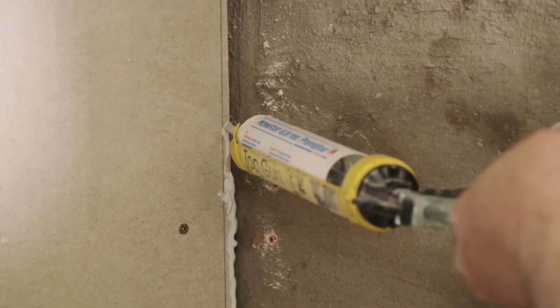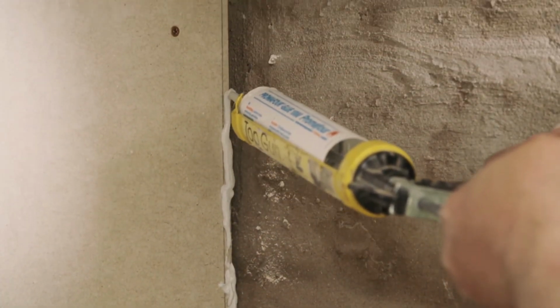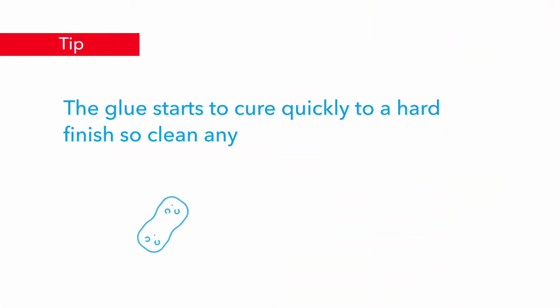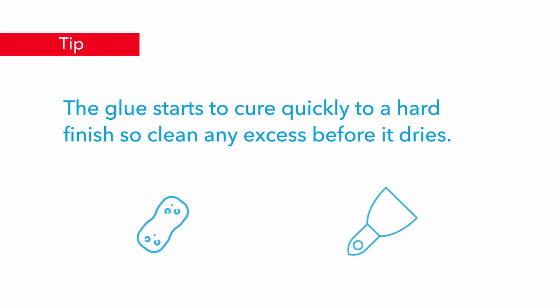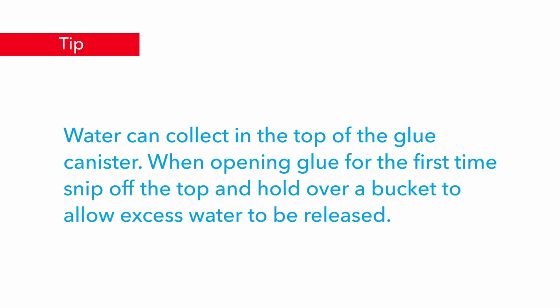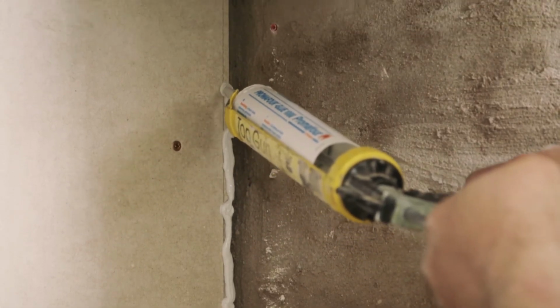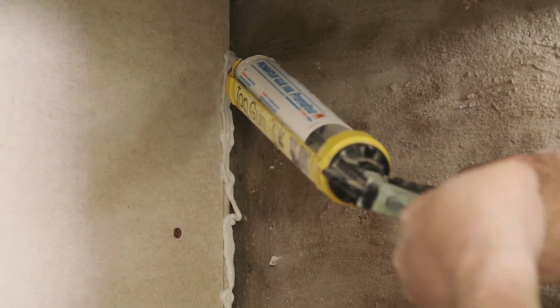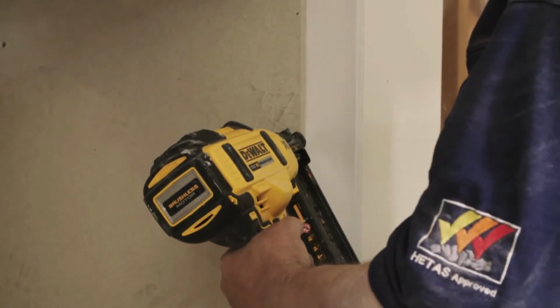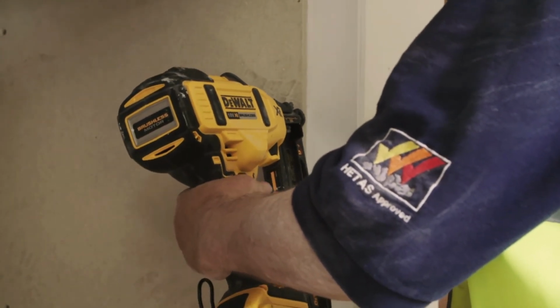Apply PROMAFOUR glue to the back, left and right corner of the PROMAFOUR board to help support the sideboards. Next, apply glue between the joints of the left and right boards to the rear board. In most installations, the edge of the PROMAFOUR boards will be hidden by a hearth. Here we show a way of finishing the boards into the fire surround if this is not possible.